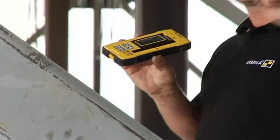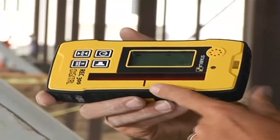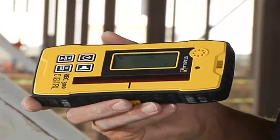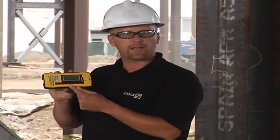We've changed how we do that now — I can do it all by myself. I use a receiver; in this case I have the D-TEC receiver that comes with this laser. I'm going to walk down to the other end of the chalk line. There's a black mark on the D-TEC receiver called deadband — that's zero. I take that black mark and line it right up on the chalk line, then walk down there.